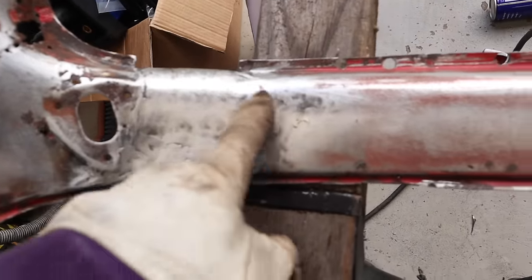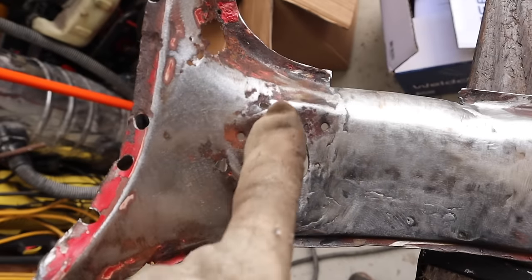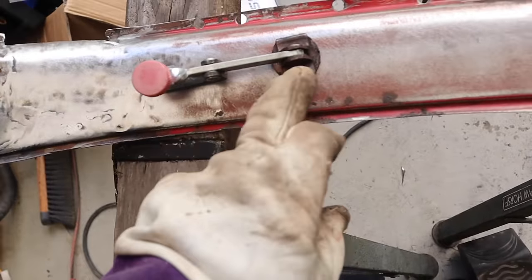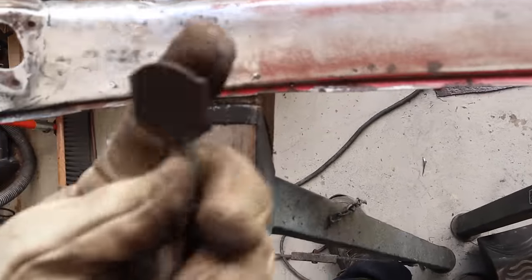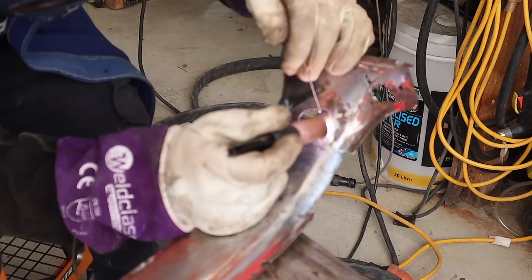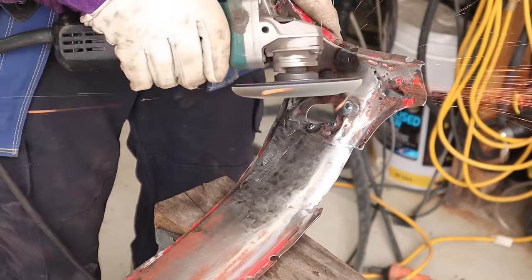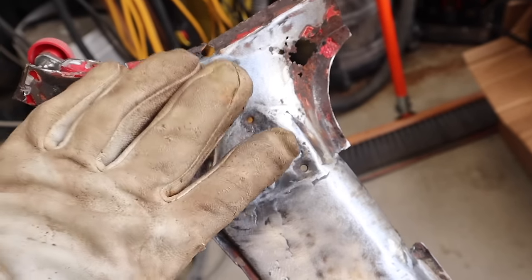I've patched in a lot of this area now and just put a tiny little patch in around here. For some of these places where there's just an individual hole, I'm going to use this tool — a magnet with a copper head on it. Basically this is a heat sink and the weld will not stick to it. I can stick it up from underneath and adjust it to magnetically hold it up under my work so the welder won't blow through, but it also won't stick. So I can just weld up some of these holes. I discovered this tool on a previous build and it's super handy, so I'll leave a link to something similar in the description. It's quite effective — that's all fixed up around that mount for the sun visor.